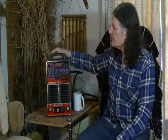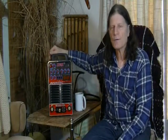60 amps will definitely cut 1 inch, 1-1/4, even 1-1/2 inch on a severance cut, which is ragged, but it will do it. So 60 amps is really good — it's in your higher amperage ratings for these systems.